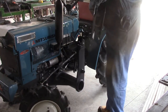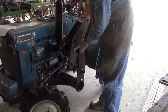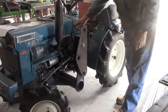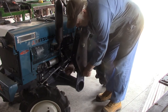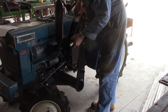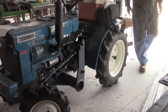And there's the keel in all its glory — finally finished and attached to the tractor. I'll be covering the build of the arm towers in the next episode, but here's a sneak preview. I've designed it to have a quick attach feature similar to commercial units. There's a rod across the top of the tower that fits into the recess in the top of the keel post, and a pin goes through the bottom hull to lock it all in place. The tolerances are good — nothing is too tight and yet there's no movement when it's fully locked in place. I expect this will be as easy to attach and remove as it is on John Deere, Kubota, New Holland, and all the rest of the commercial units. We've finally wrapped up the build of the keel — it's on the tractor and ready for the front end loader. If you'd like to see more of my projects and reviews, you can go to my channel or browse to my website. Thanks for watching, until next time.